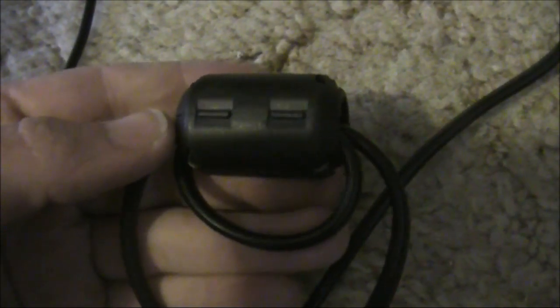If you run out of small ferrites, you can always use a larger one and wrap the wire through it. Even if you don't think adding a ferrite makes a difference, it's better to leave it there. That's because noise is incremental. Once you get rid of the bigger noise sources, you'll find smaller and smaller ones. Every little bit helps.